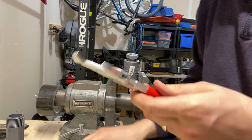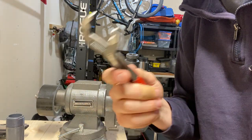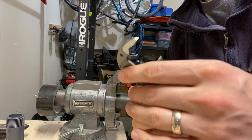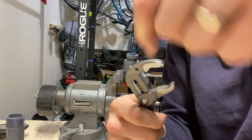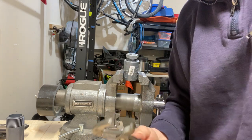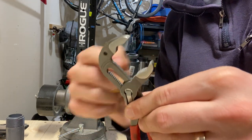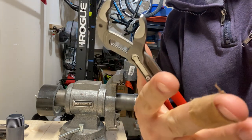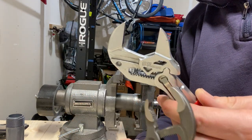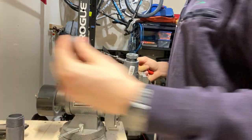The plier wrenches give you a lot more clamping force for how much you're putting in, but the Cobras make up for it with this hook that means you don't have to apply as much force from the top down. It's got the teeth of a channel lock too, so the top helps you and then the teeth biting on the bottom mean that once it's locked in, your grip strength doesn't matter anymore. The Cobra makes up for not having that force-multiplying action by the grippage of those teeth — they're really important for how well these work.